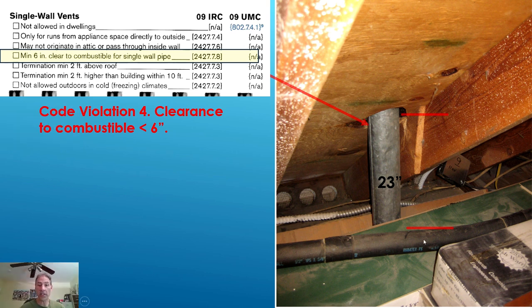Once we exit the ceiling of the garage, we enter into the attic space above the garage. You need to know the measurement from when it enters the attic space to where it leaves the roof line. In our case, it's 23 inches of single wall vent pipe. There is a clearance to combustible materials requirement — the minimum is a six inch clearance for single wall metal vent pipe. This picture shows you do not have six inches. That's a code violation.